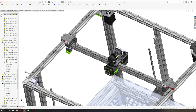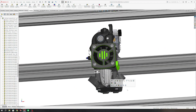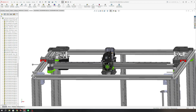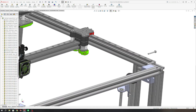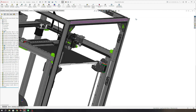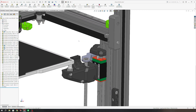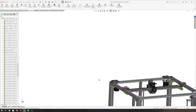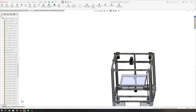I'm also going to be making some small changes because this design currently uses the Eddy Current Probe. But I'm not sure if the bed will work with that since it's going to be an aluminum bed with glass on top. We might switch that out to a regular proximity sensor that came with the original printer, because if it worked for that it should work here as well. The purchase parts are very similar to the original V-Core 4, and the only things we're changing are to make stuff fit with the 20mm extrusion. There's been a handful of stuff I've had to reverse engineer and remake. The entire design isn't done, but by the time we get to that point it should all be finished.